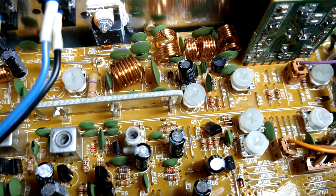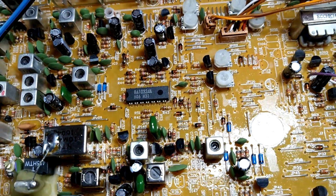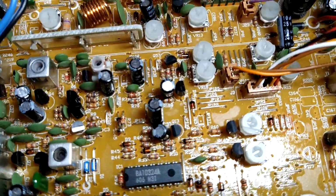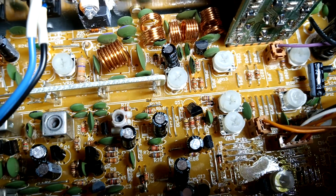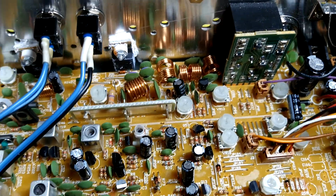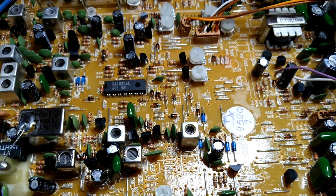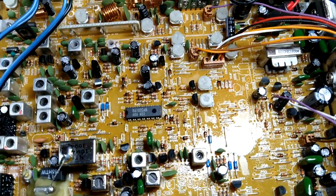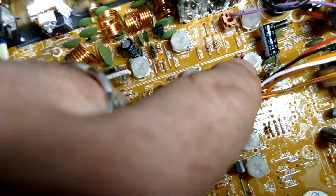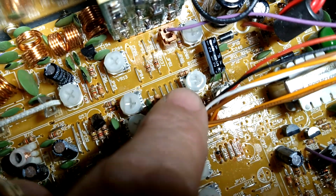And I'm doing it just like you would. I just got to go in here and look around and find it. Yeah, I see all the other ones. I didn't have to adjust the high power. It was already good. There's VR16. There's VR13. It's been a while since I used to be in these Galaxies all the time. I really kind of forgot where stuff is. Oh, right here. Okay, here's VR14 right here. VR stands for variable resistor. That's what these are. So the same thing.